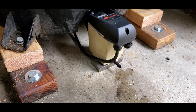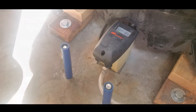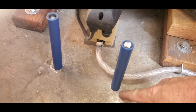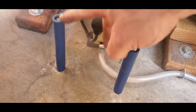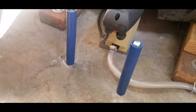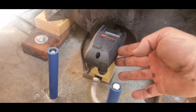It's been a few days of using the compressor — working perfect. We've installed some bumpers to keep from hitting it. We've got a piece of cement with half-inch 13 red heads down into the cement with some all-thread and tubing. That way if you bump it with your foot or a cart or something. It's back in the corner so you shouldn't be walking past here too much, but that's just in case, because it is hanging out from the side of the compressor.